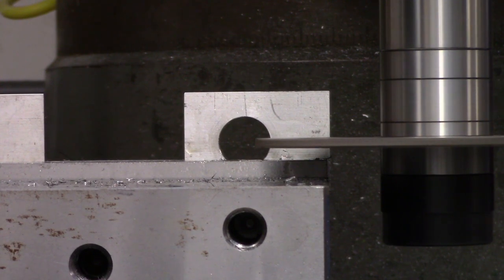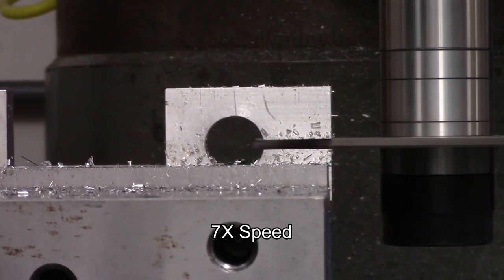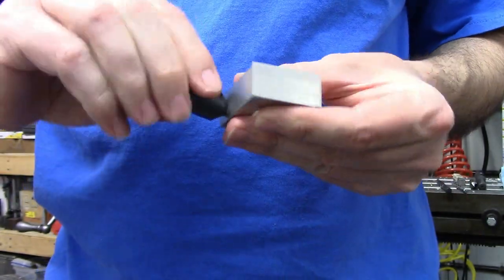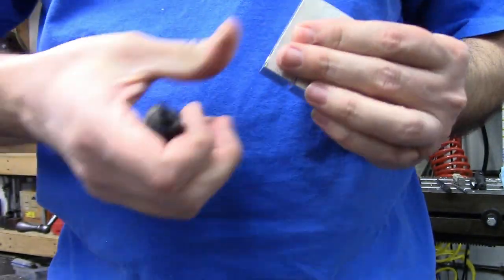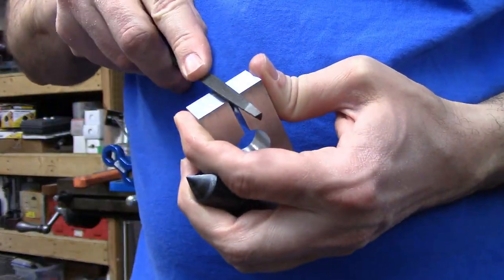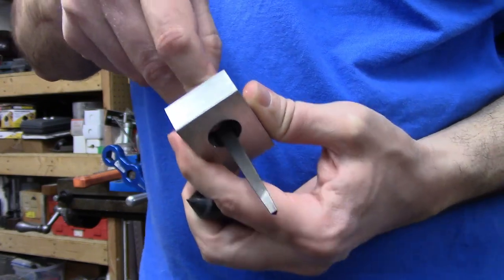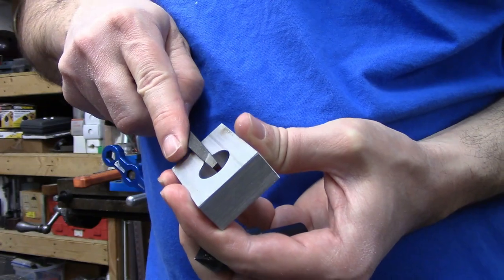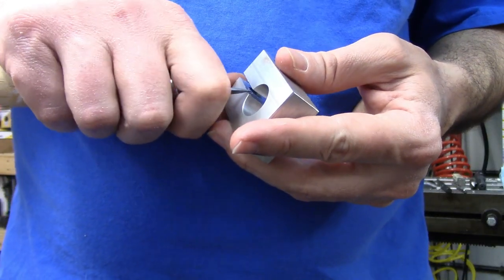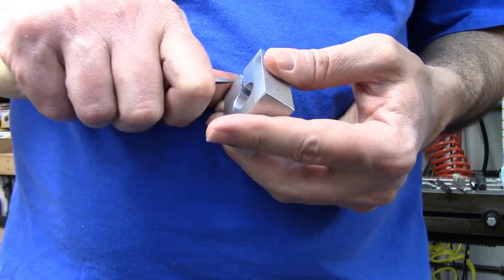I made this cut all in one pass and lined the depth up by sight — as long as the saw was going to intersect with the bore, I knew I was good to go. Make sure you use plenty of oil on the saw and take your time on the feed rate. This is aluminum so it shouldn't pose any problems to the saw. There is a lot of deburring to do after these operations. I'm using a countersink by hand to take care of the holes and a triangular file to get the easy parts of the slit. The triangular file is perfect because it can deburr both sides of the cut simultaneously. It doesn't work very well on the sides though, so I'm using one of my triangular scrapers for that. Be gentle with these because it is very easy to dig into a soft material like aluminum.